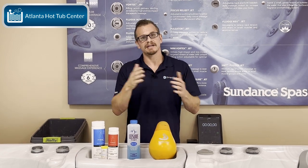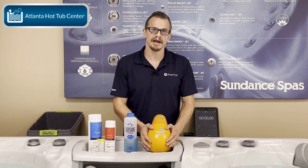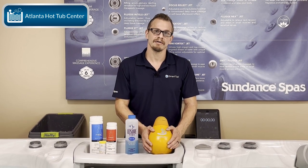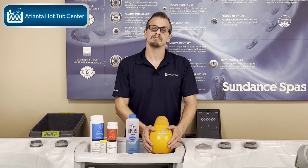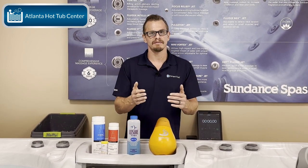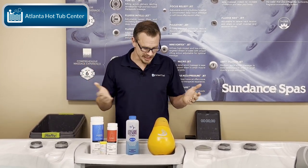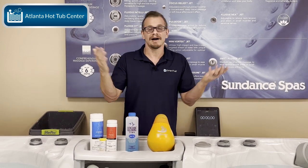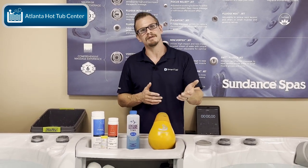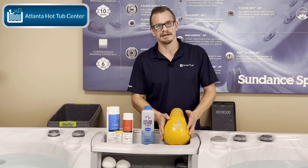So that goes back to why I love the chlorine levels being low in the hot tub, and that also goes back to this product, right? I want the water to be conditioned to be good for my skin, hair, and body. Now, furthermore, this product helps to balance chemicals. It has buffers in it to help keep pH in balance, which is why I never have to use pH Balance Plus or any of that stuff to try to balance the pH, because I'm on Silk Balance, and this does help to balance pH levels every week. If you're using this product, you add 4 ounces of it a week, or if you have it in pod form, you add 1 pod a week, okay? And we're going to do that today, so you're going to get to see it, all right?